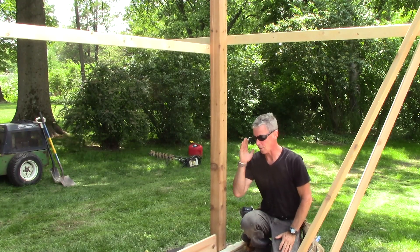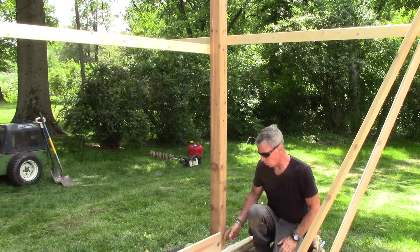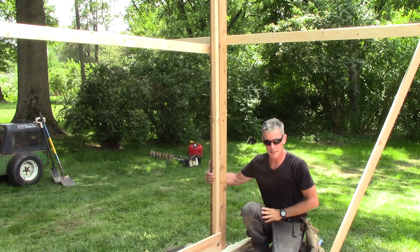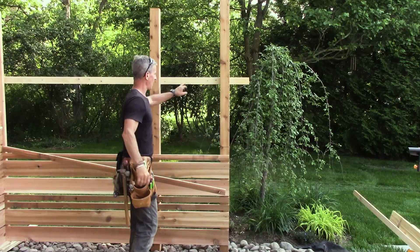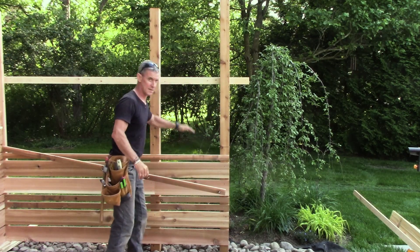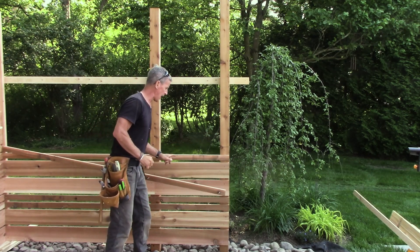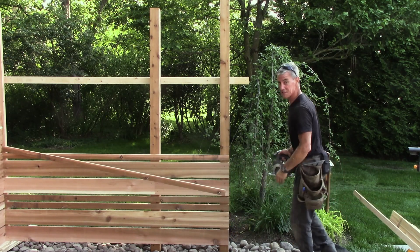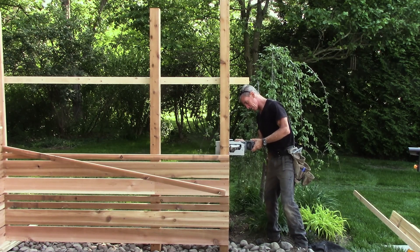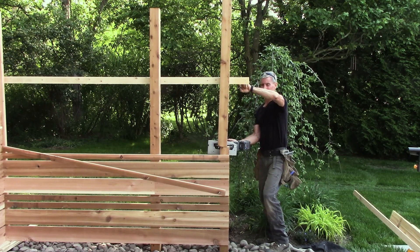Because the face of this post is parallel with this run and the face of this post is parallel with this run, the joint is unsupported at the corner. Solution: just going to take a cedar nailer and tuck it behind, and we'll fasten to that — closes up the corner nicely. Another master use of strapping: cutting the posts. This design is stepped up and down, so I ran all my posts high, determined what height we liked, removed a piece, and now I've got to make this cut reasonably clean — three sides cut already, and because it's just me here, I need all the help I can get from the strapping.